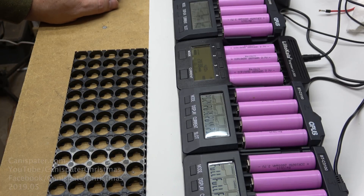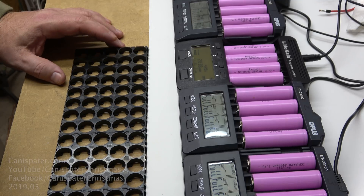I'll test them in a week. If they've got more than 4.1 volts — I think 4.1 or higher is what I'm going to do. Daniel does it at 4.05 and I'll see what happens with cells that are a little bit older. I did have one cell so far in all the testing that was 4.09; the rest were 4.1 or better. So I may adjust that, but right now it's going to be 4.1.